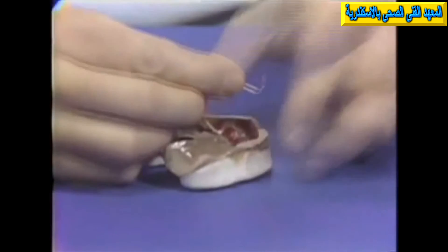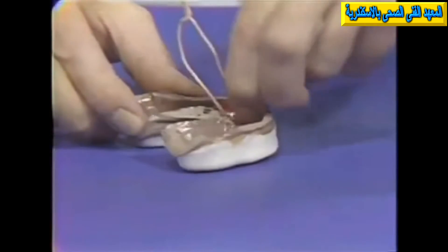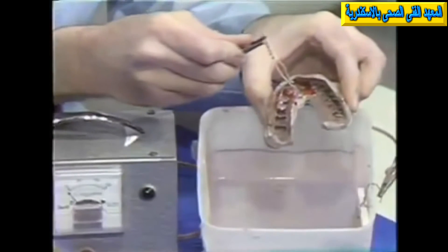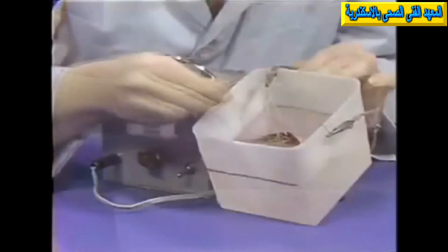One wire goes in one direction and the other wire is applied in the opposite direction. If the wires are bent in opposite directions, they'll retain the rubber impression better when it's immersed in the solution. This will lock them in place so that we can carefully immerse the impression into the solution and a minimal amount of bubbles will be trapped in the dies. After it's submerged, take an eyedropper, fill it full of the solution, and carefully remove any bubbles which may have been trapped in the impressions.